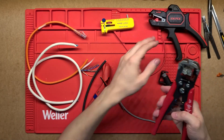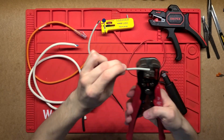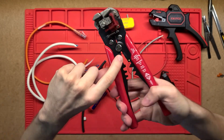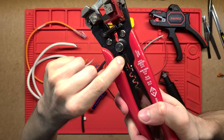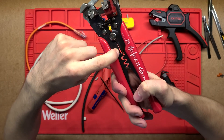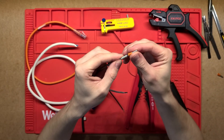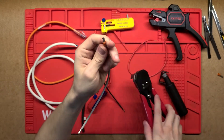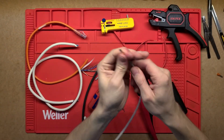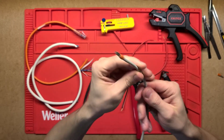Most of these — actually these two over here — have the same thing, but I'll talk about that when we get to it. You've got that arm you can adjust, strip to a certain length, put it in, pull it. What this one also has is a cable cutter down the bottom here — just this little blade that you can press up against the other side. Then just below that we've got a bunch of crimps: one big insulation crimper and then three smaller ones. So where that comes in handy is, you just stripped that cable and if you then crimp it, there you go — you can crimp that up pretty well. With this one tool you can use it as a cutter, stripper, and then crimper, so you can kind of get that whole job done nice and quick.